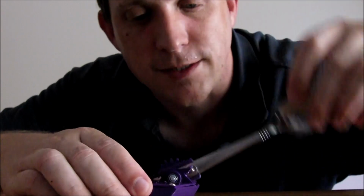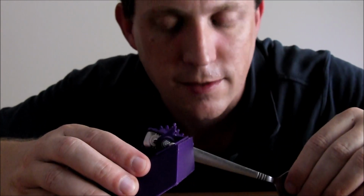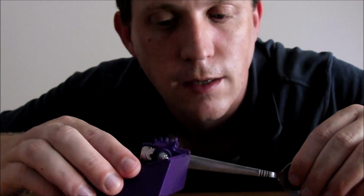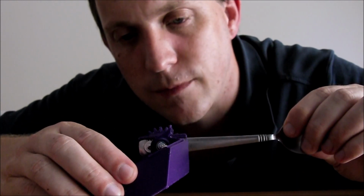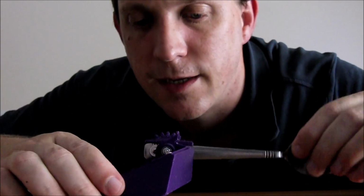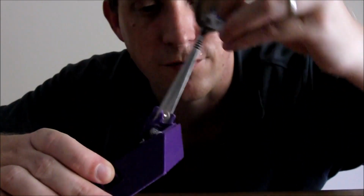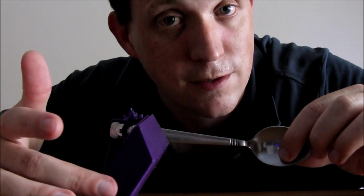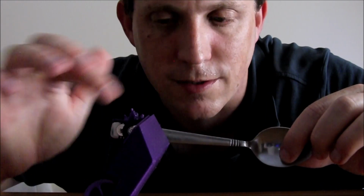So allowing the axe to swing further and hit the floor rather than hitting itself inflicts more damage on the other robots. Although technically lifting the robot reduces the amount of energy that's in the axe, it's still technically taken 180 degrees to swing that far, even though the robot's also lifted about 60 degrees. So it's still got the same amount of energy even if the nose doesn't lift. So you lose nothing by allowing the nose of your robot to lift.